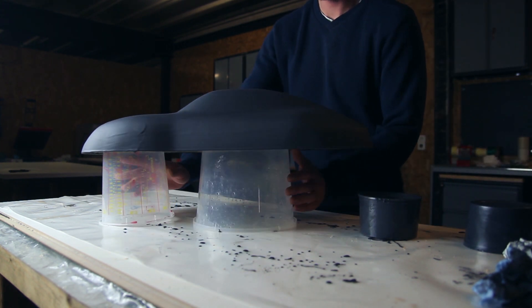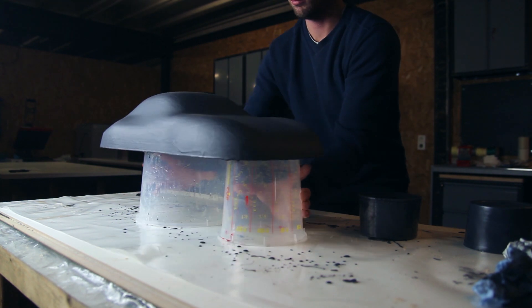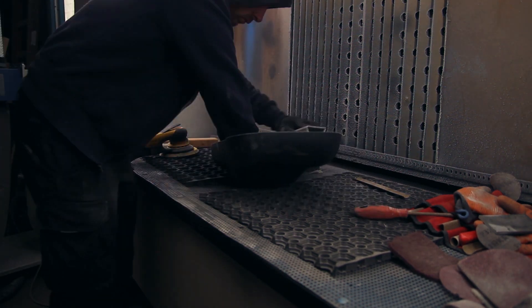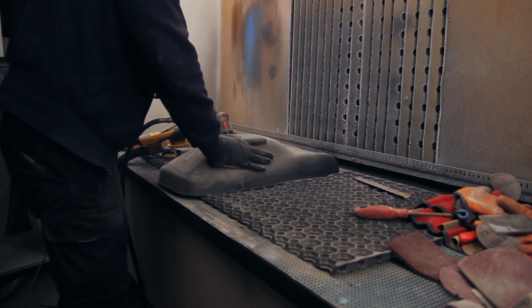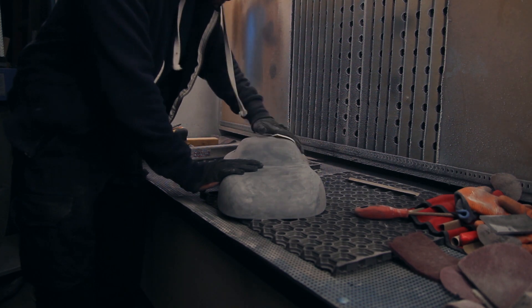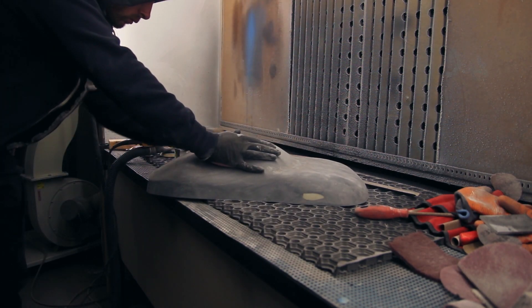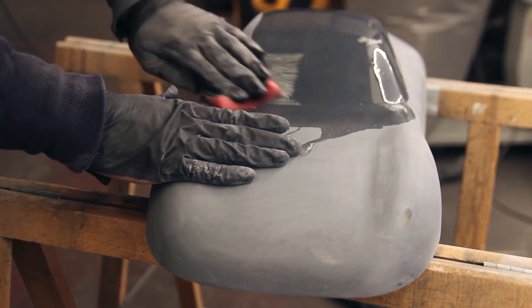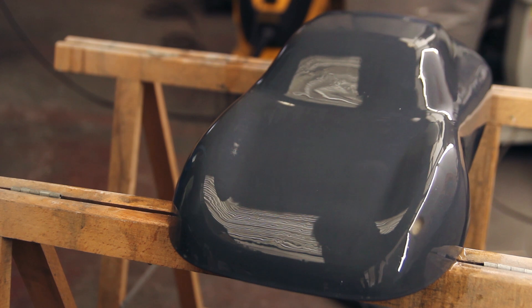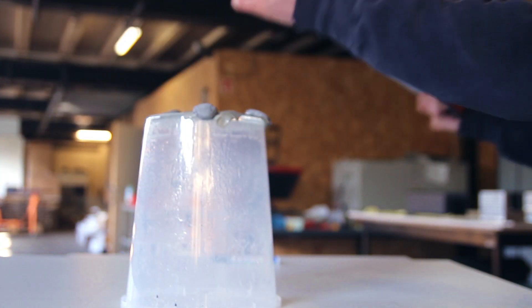This is the result after two coats. As you can see there are still some drips and brush marks, but it's not a big problem because we'll sand it flat before spraying a final finishing coat. I sand all the edges first, then use a sanding machine over the entire part — around 150 grit on the machine and then 240 by hand. It's not important to have a high gloss finish at this stage; you want a good mechanical grip for the next layers and to remove all imperfections from the first coats.